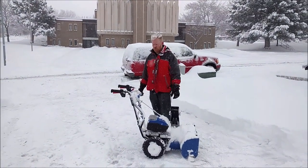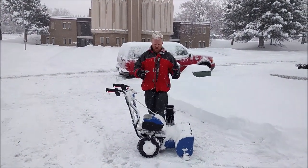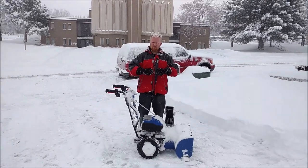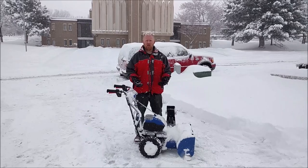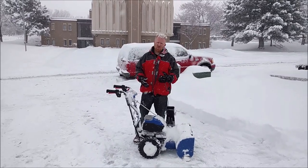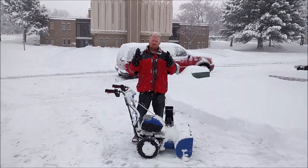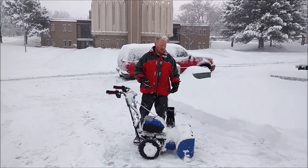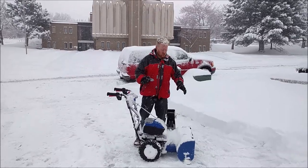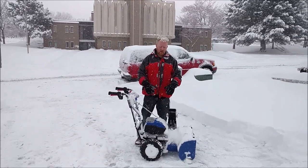In the really heavy stuff in the gutter — probably five or six inches of slush plus powder on top — if you push too fast into it, the electric motor circuit breaker trips and just cuts off for a second. You have to release it and go again. It shuts itself down so it doesn't fry itself. You can back it out and restart. So if you've got something like a newspaper stuck in there, you're not going to destroy it — it just shuts itself down.